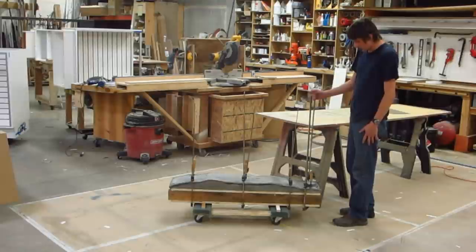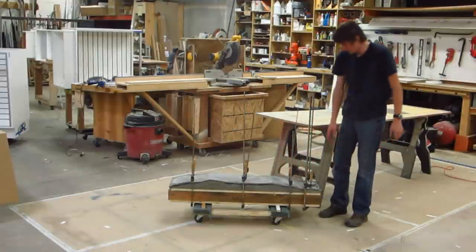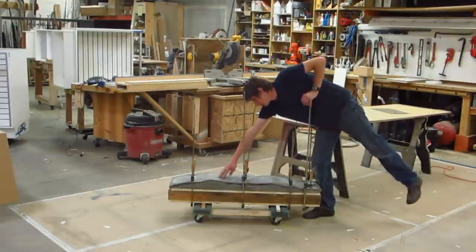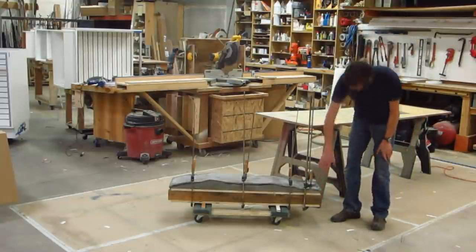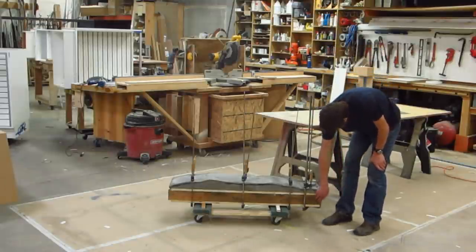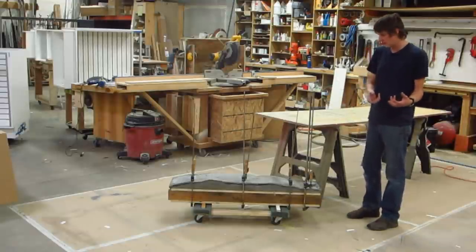After this, what I've gotta do is bondo a few places up, like the cracks where there's gaps now, and these two spots where it leaked into the mold and caused it to swell up, so there's dents there. And then I get to build the wooden frame for this, which is going to allow me to pour the other half of the concrete press. So I'll be able to build up the walls and just screw them into the VLAM. And then when I'm done, I'll be able to unscrew them from the VLAM.